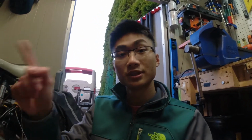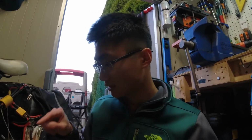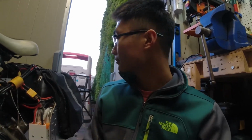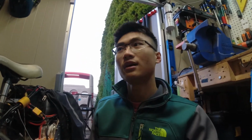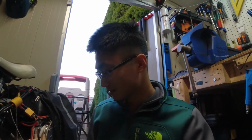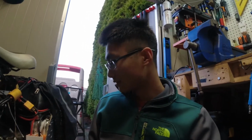So I am able to shift in the rear, but I'm not able to shift through the front, because I'm using that shifter and cable to run the mechanism to engage and disengage the friction wheel. As for safety, if there's a fault and the VESC decides to run full throttle open, with this system I just disengage it and the motor just runs full beans, not being connected to anything. So I can still slow down, hit the brakes or whatever.